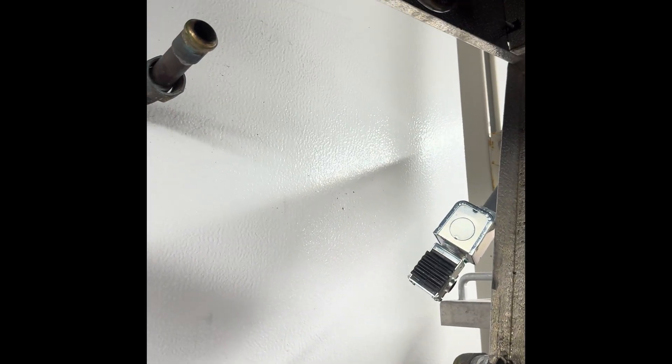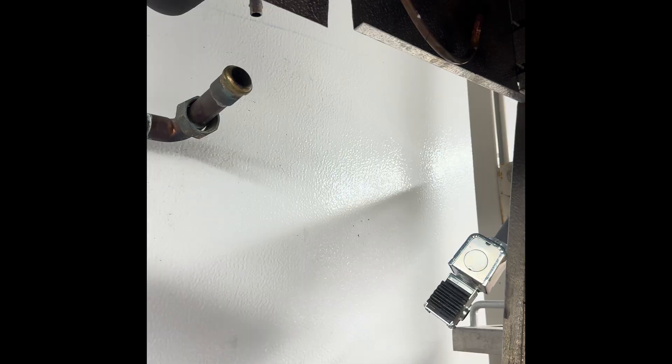So I chased out the line set — there's no old dryer up above the box or anything like these did in the old days. So I totally blew down the system with nitrogen, the high side line and the low side. The low side was able to catch all of this — look at this crusty old oil from over the years. This is an old box. And then look what's inside of here — this piece looks metallic, maybe a piece of an old compressor or something. These look like rocks, like there was a rock in the line. Could be some old desiccant from an old dryer.